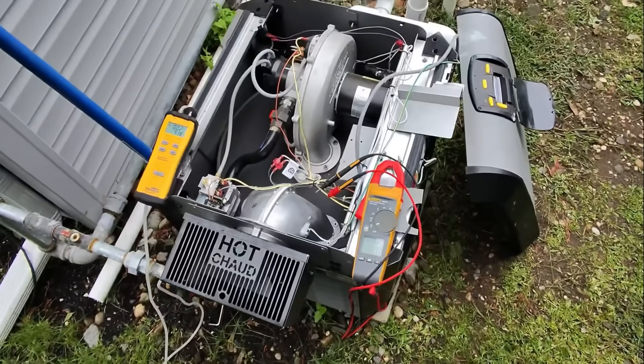We're reading a little over seven inches of water column. The gas valve opens — we have slight ignition for a split second — but we're not sustaining enough fuel once that main valve opens. Looks like a fuel supply issue. Taking a look at the spec: minimum gas pressure inlet is four inches of water column, and we're seeing a differential of negative 2.9. We need to maintain a minimum of four inches even with the gas valve open, and we don't have that.